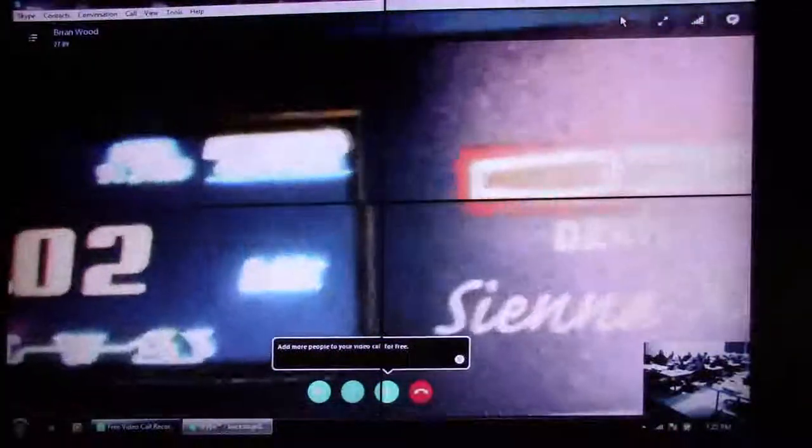You can change filter selections by just turning this knob. When you have this multi-function switch, it's got filter, band tuning, notch filter, voice recognition, scanning, memory, CW buffers, and so on. In each one of those positions, the function of this knob changes. It's got a built-in pushbutton switch as well as a knob. If I'm in filter, I can change the bandwidth of the roofing filter. Push the button to get to the other one, and I can change the bandwidth of the 455 kHz filter.